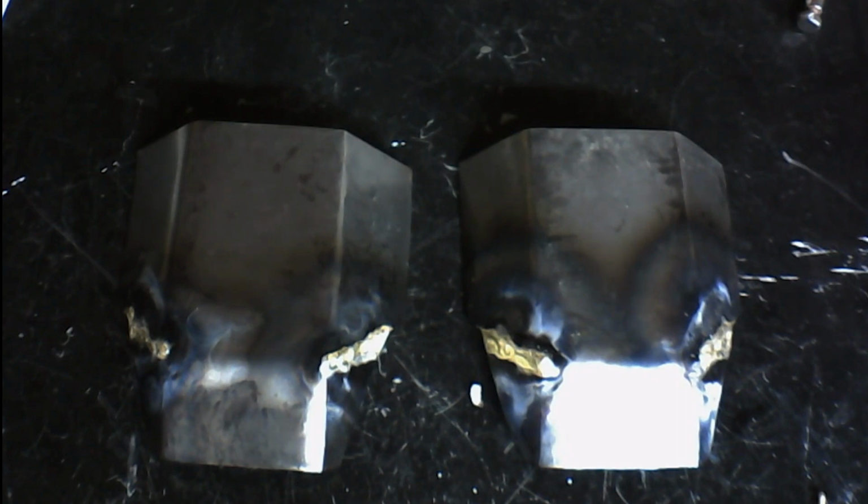It's not like actual welding where you're melting a steel rod, or using a tungsten wire or something of that nature to melt that and join two pieces. We're using a lower melting temperature metal such as bronze or even silver to do the joining of the pieces. So you don't have to have a super hot flame.